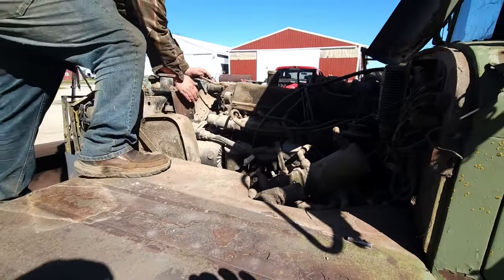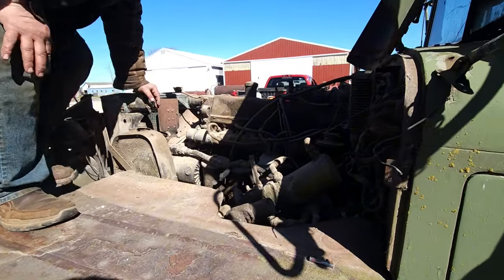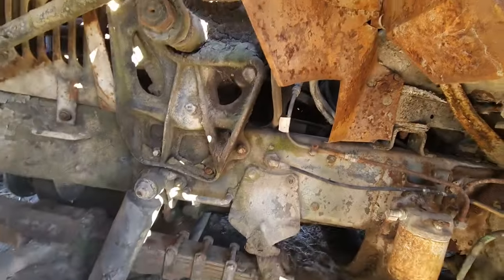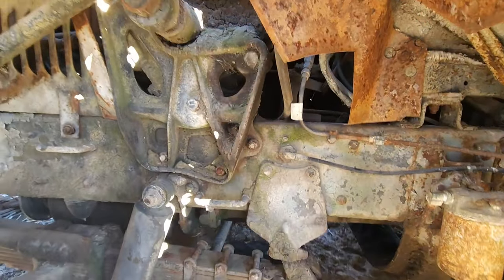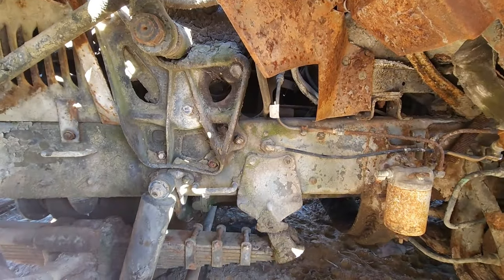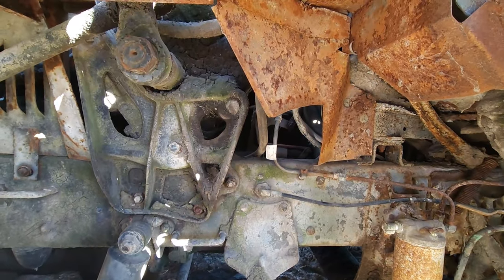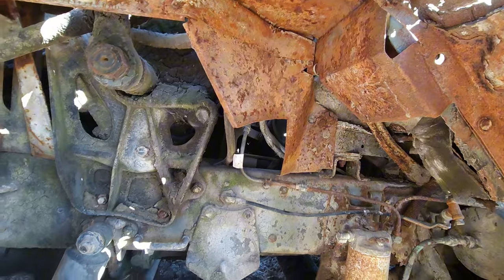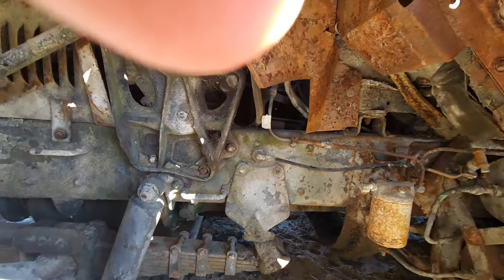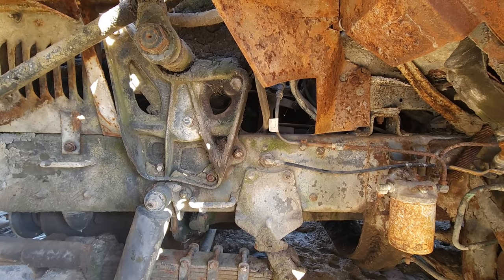I did grab the fan the other day, and yep, engine still turns. We just need to get that starter to go. Maybe I'm wrong. I see the starter. There it is. You know, it could have a back cable going to it too. Yep. Pedal might also not be pressing it far enough.